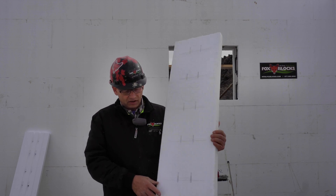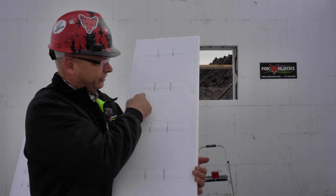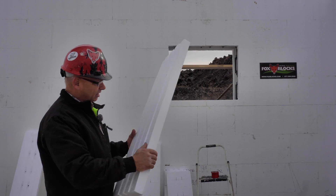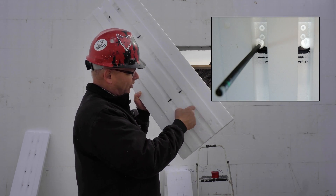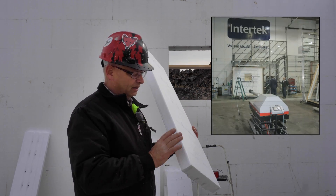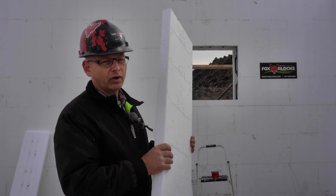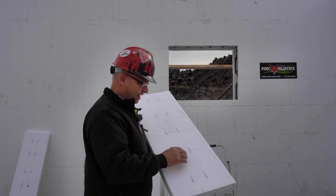What we've done with the fox buck is put fox faces every 16 inches. We recommend you cut those sections out to monitor the concrete placement and make sure there's no air underneath the fox buck — you want it full of concrete. Because once it's full of concrete, if you get concrete in these grooves and into these holes that hold onto our tie, the buck is not removable. In fact, it's passed wind tests — flying debris hitting it, it will hold your window in place — so tornadoes, hurricanes, this will actually work and it's been tested.